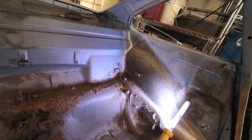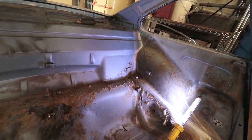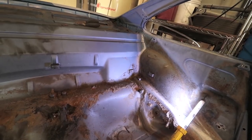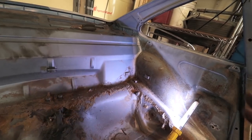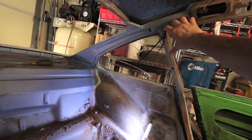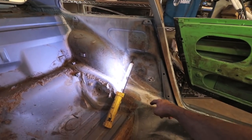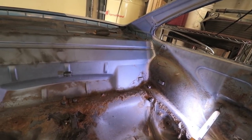This is not only for safety, it's gonna be stronger, but it's also there to improve the performance of the car. It's gonna increase rigidity, and it's also gonna take some of the load off the shock turrets or the coilover turrets and put it into the roll cage and then distribute it throughout the car. So it's gonna be transferred up here into this corner, and then the main hoop is actually gonna get welded to this B pillar, and then it attaches down here to one of the strongest parts of the car where the main hoop attaches.